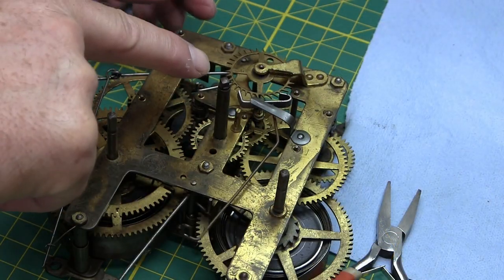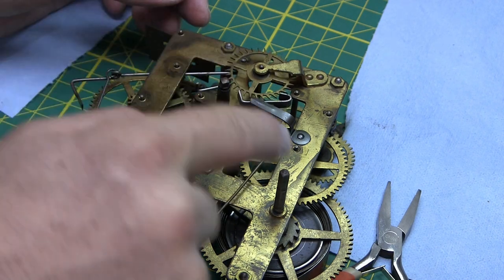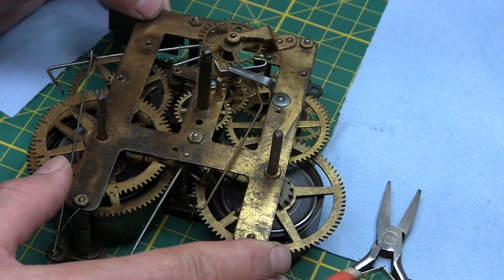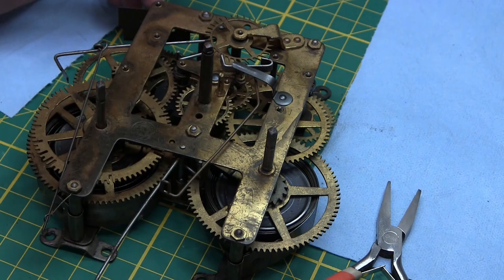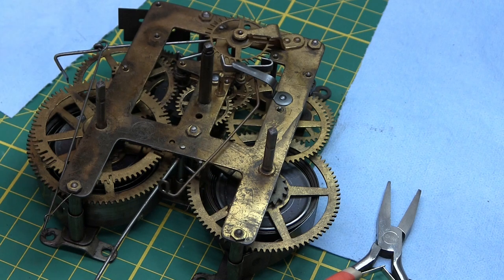You can see how that's running — that means it's getting power from the spring. So as long as there's power in the springs, there's potential for danger when you take this apart. The first thing I'm going to do is wind up each arbor and put this retaining clip on the spring.